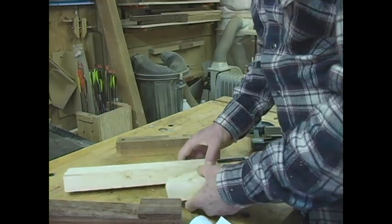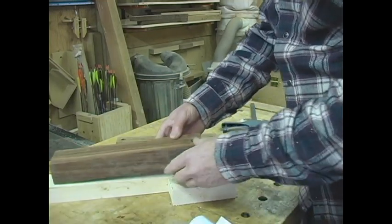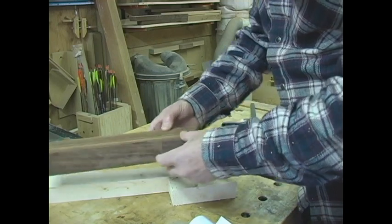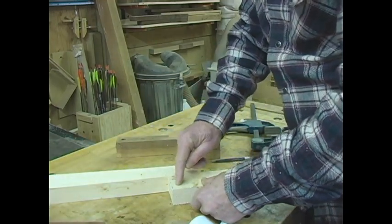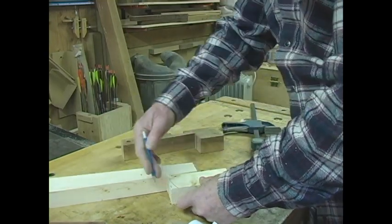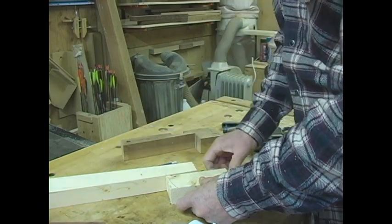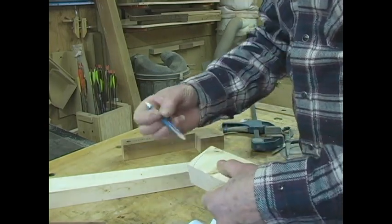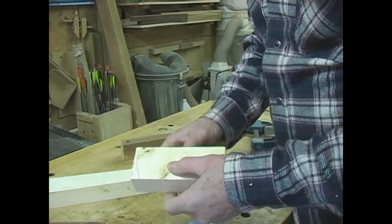We're going to place this block on here so it resembles this shape. Since this is a seven-degree angle, I want this edge coming back seven degrees like that, so it comes in and is 90-degree supported as the piece goes through. That's easy — we'll just go to the miter saw, set it for seven degrees, or use a table saw with a miter gauge. We're just going to cut that block to seven degrees. Here's the jig with the piece clamped on — take a square, put it in here, and you can see it sets square so when the piece is running through there's less chance for it to jiggle and you get a smooth cut.